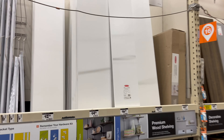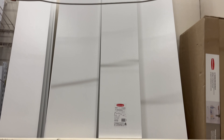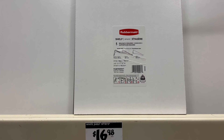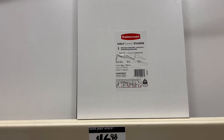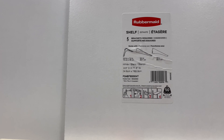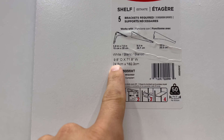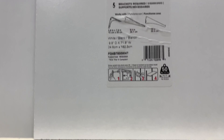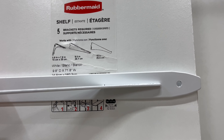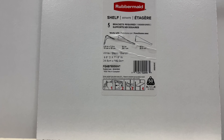We're hanging out here at Home Depot and just want to give you a little more insight as to what materials we purchased and used to build the shelves in the Lego room. One problem I ran into was a brain fart — I was thinking a base plate is 10 inches deep, so I'm just going to go with 10-inch deep shelves. We ended up buying the 10-inch deep Rubbermaid shelves, but the actual depth is only 9.8 inches — six feet by 9.8 inches. So when you have a 10-inch long bracket, you're actually going slightly past the actual shelf, and I'm still going to have to bump it out about three-eighths of an inch. Kind of a bummer.